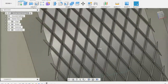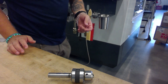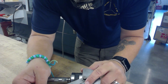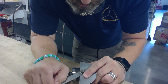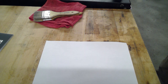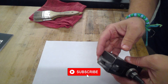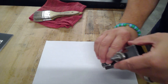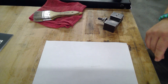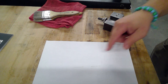I could make it a little deeper if I wanted to — once again, it's a pretty decent representation of what a knurl would actually look like on a piece like this. One thing I have to do is have a good idea about what angle this has. There's not really a great way to do this because I'm dealing with a circular surface, but if you take a protractor and lay it up and find a reference point, you can pull off an angle. I found this to be roughly 32 degrees. Now the next thing I need to do is get an idea about my pitch on my knurling tool. I'm going to take a knurling tool and find my medium knurl — this one right here — and roll it on this piece of paper, just one wheel, to get a pattern. I want to get at least an inch of that pattern so I can take a measurement and determine what my pitch is — how many knurls I have per inch.